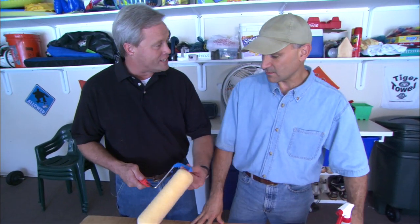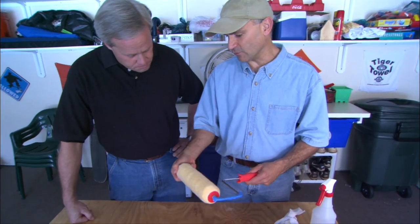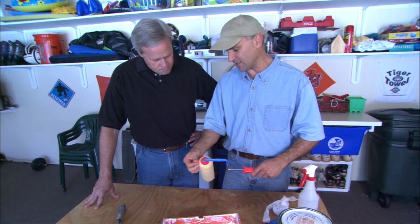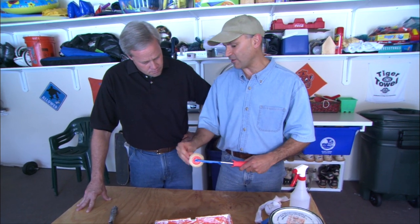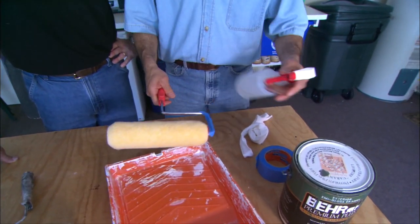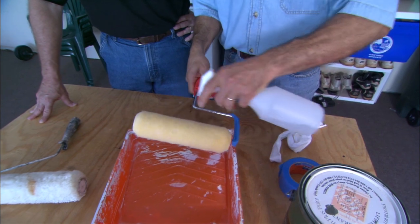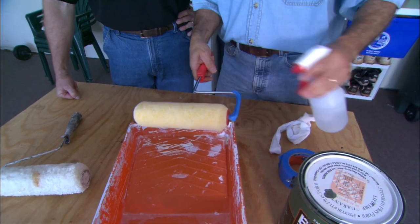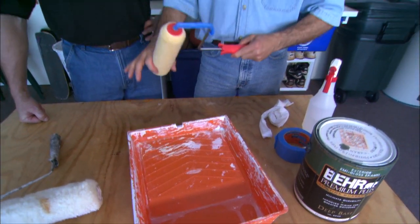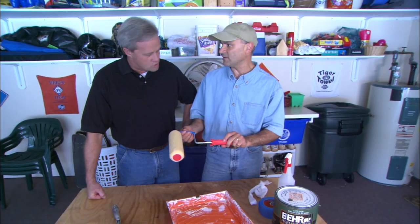With the type of tape it is — painter's tape — it's really easy to come off later on. The other tip has to do with using a brand new roller sleeve. When it first comes out of the pack, especially around the end, you have a lot of loose lint. This will come off in the paint the first time you use it, if you don't wet it down and wash it off. Use a spray bottle like a plant mister with water, get the roller good and wet, then roll off the excess water on a clean paint tray or right on the wall itself. That will get rid of all that lint before you put it into your paint.